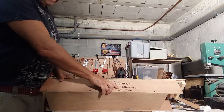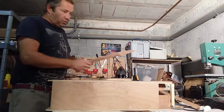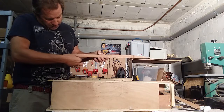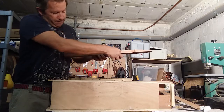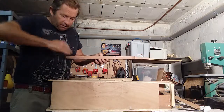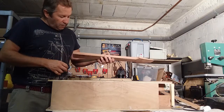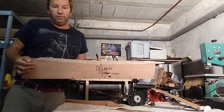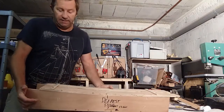The deepest point is at the seventh to eighth fret. Without the fingerboard on, you route down to about 12 millimeters at the seventh fret, and come up to about 8 millimeters at the ends - 9 millimeters here, 9 millimeters here, 12 millimeters in the middle. That gives you a slight curve, which is just enough to counter the string tension. You can get the exact depths from Google.